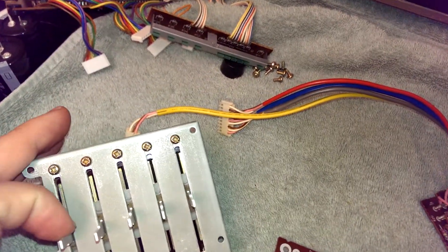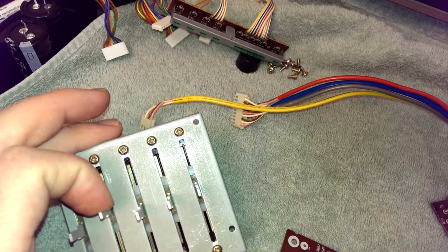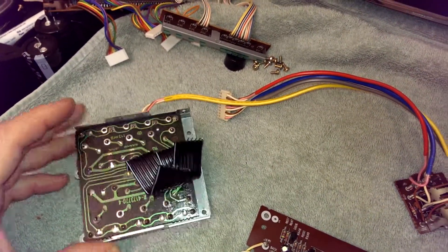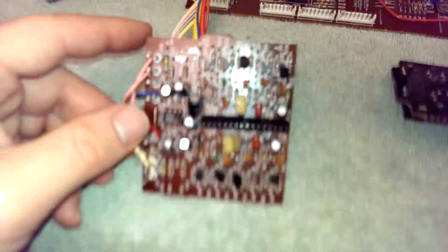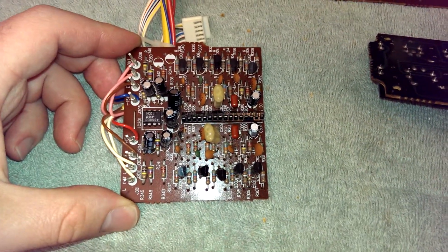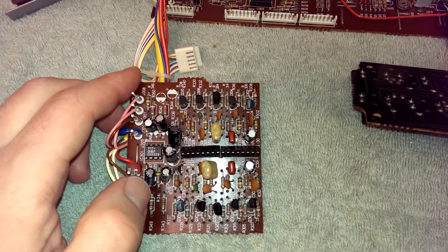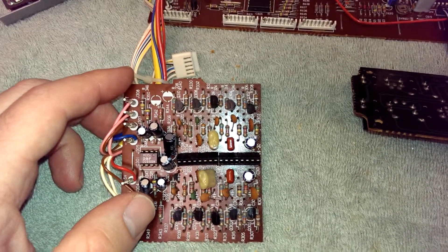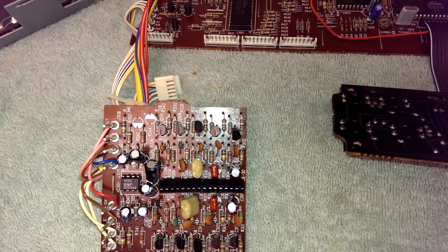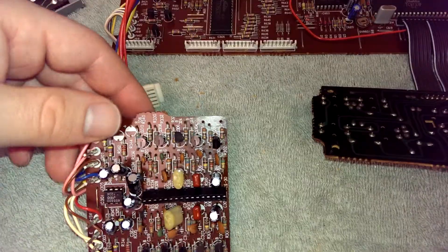These have already been three-step cleaned — they're already re-lubricated and deoxidized. Shouldn't be any static at all when you adjust these; they should work just great. In the back there, there's a ribbon cable that hooks it to this unit, which is the actual electronics of the EQ. It has a simple one-transistor amplifier per each band on each channel.